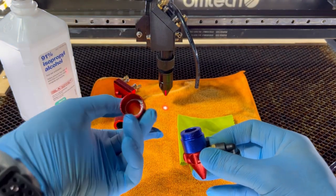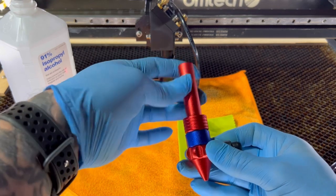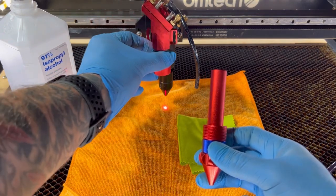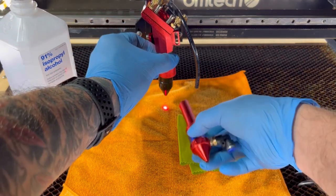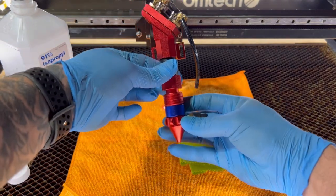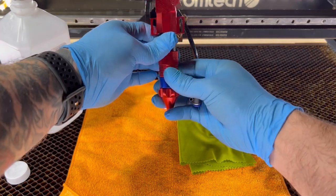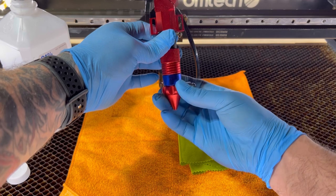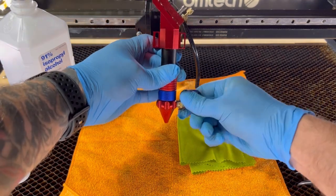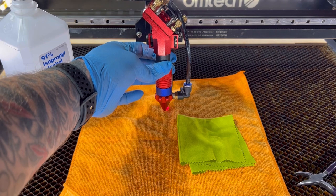For this part, I removed the lens earlier, so tighten this back up. Your laser nozzle is gonna be mounted right there, so you might need to lower your bed to get it in there. Loosen the collar, slides back up, tighten it, tighten everything. Take the air line, point it back up, plug in the air line, and you're ready to start lasering.